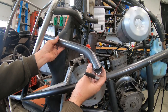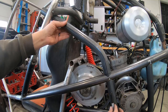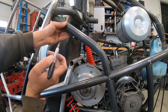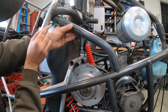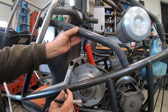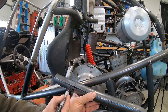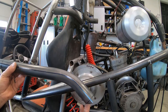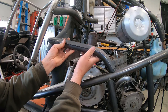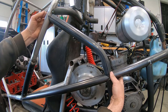Here's the hand-notched tube — came out really nice, sits on there flush. You can see what I'm trying to do: I'm making a continuation of this tube down here. It looks lined up pretty good. I made a mark right here and it shifted over about an eighth of an inch, so I can measure from here, do a half-inch mark, make my angles, and cut it just like the other side. Here it is hand-notched on both ends — came out well. Let's see how it fits. Oh yeah, that looks slick.